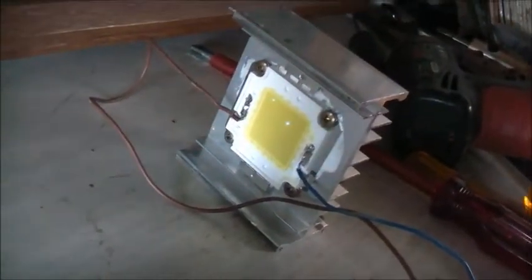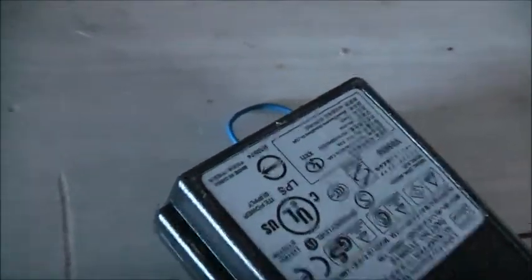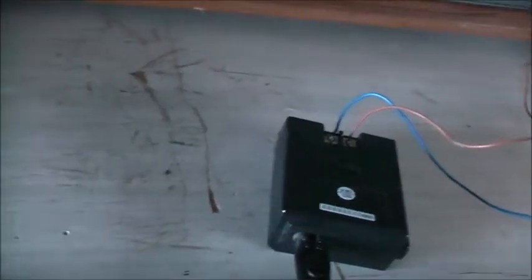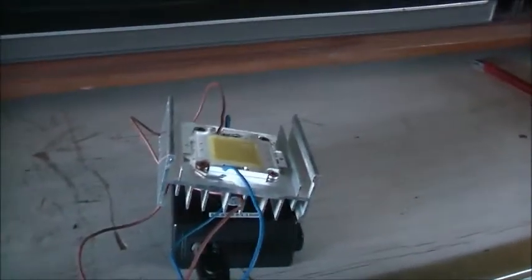I can't read that - my eyes are bugged. Turn this bloody thing off. You can see the little dies in there discharging the capacitors in the power supply. That is a boot-arse light - it blinds me and I'm not even looking anywhere near directly at it. It's still blinding me - not good for your eyes. If I loaded this thing right up it would pull one amp from the mains, but it's barely pulling anything like that. I'll need to make an enclosure with a lens - I can't get dust on that gel surface as it will stick dust to it like crazy.